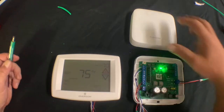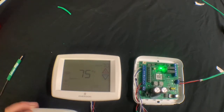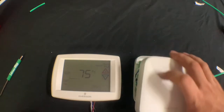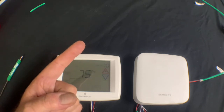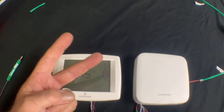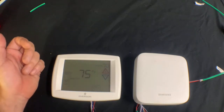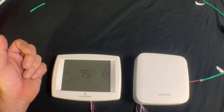And there you have it. If you have any questions, concerns, or comments, please put them in the comments below or contact me directly. Before I let you go, here are some key points. Key point number one: the contractor must utilize an additional 24-volt transformer. Key point number two: the contractor must set up the third-party thermostat as a straight cool system utilizing electric heat. Key point number three: if installing on a high-wall system, they will also need the sub-PCB in order for the system to interface with the high-wall unit.